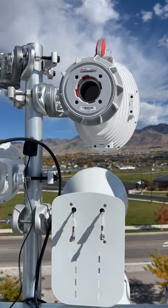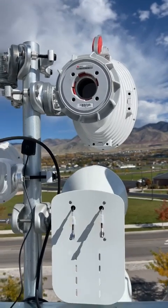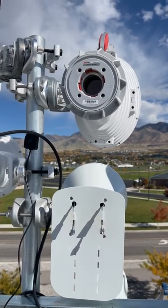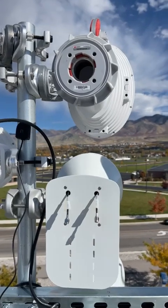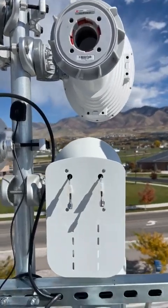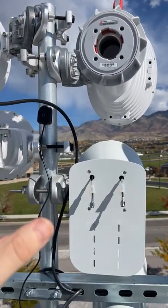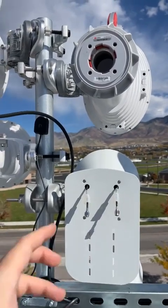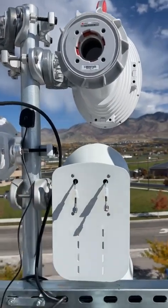I knew we were going to get more gain — I was curious about the noise levels, and we didn't look at the noise column on those screenshots. We will post the screenshots and show the noise. The common wisdom of using the asymmetrical because it's higher gain seems to be correct. It seems like the asymmetrical does in fact outperform the 30 degree symmetrical when you've got a tight pocket of subscribers.